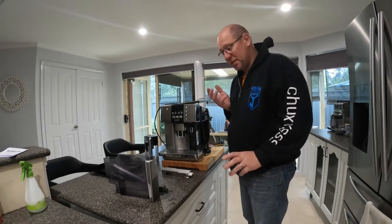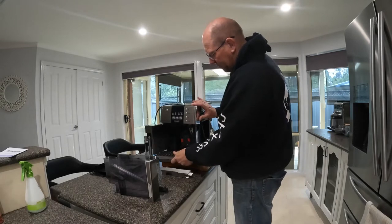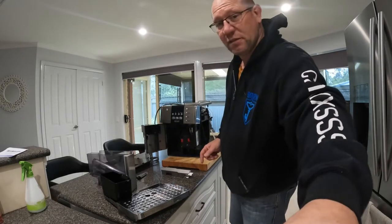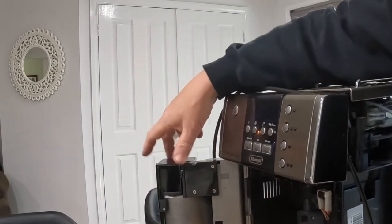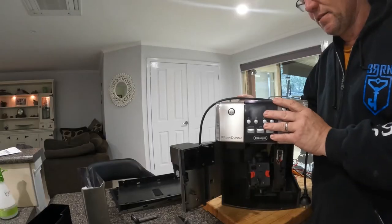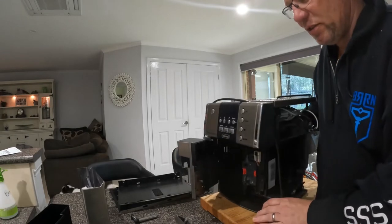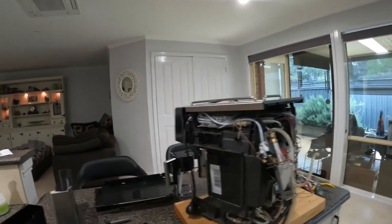I took this off to check that there was no water cutting through here, because I'd never touched one of these before. But they're not that hard if you're a technician, you should be able to do this. I took this out and got it out of the way. I unscrewed this bit here — there are three screws, one small screw down there and two up the top. I used this to engage the actual reed switch inside the unit. That showed me that water was leaking down through here and dribbling across, so I had to figure out where the water was coming from.